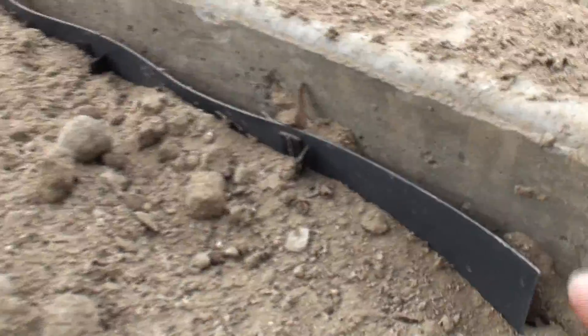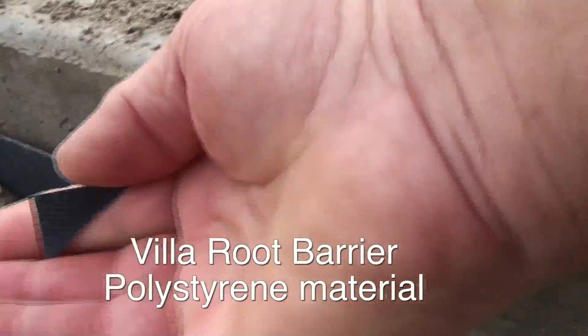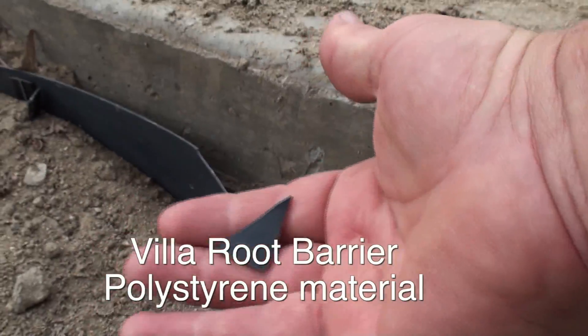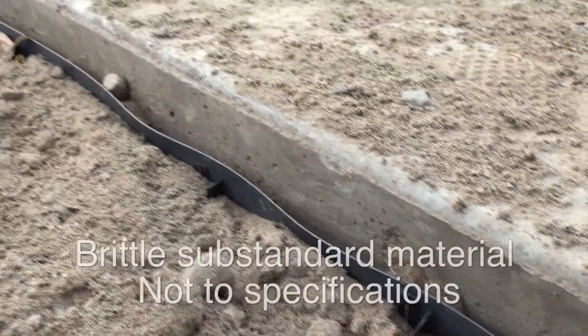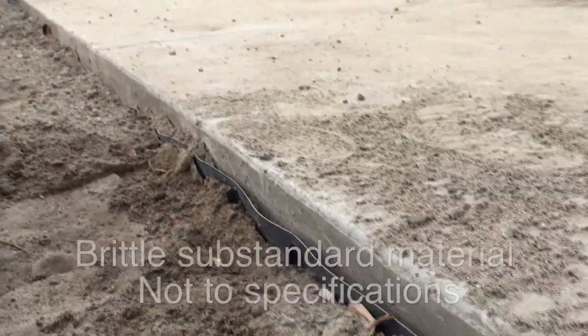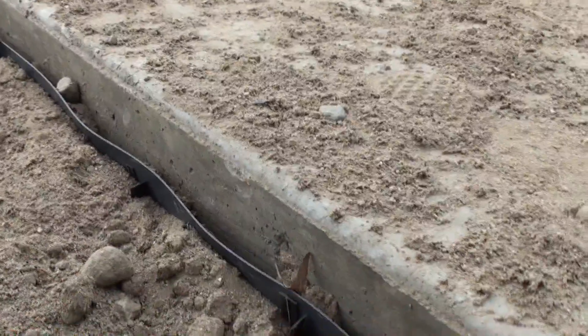As we can see, this is a thinner wall styrene material, very brittle, and where the ribs are actually coming apart — as we can see here, it is actually substituted. This material going in the ground as styrene does not meet the specifications.